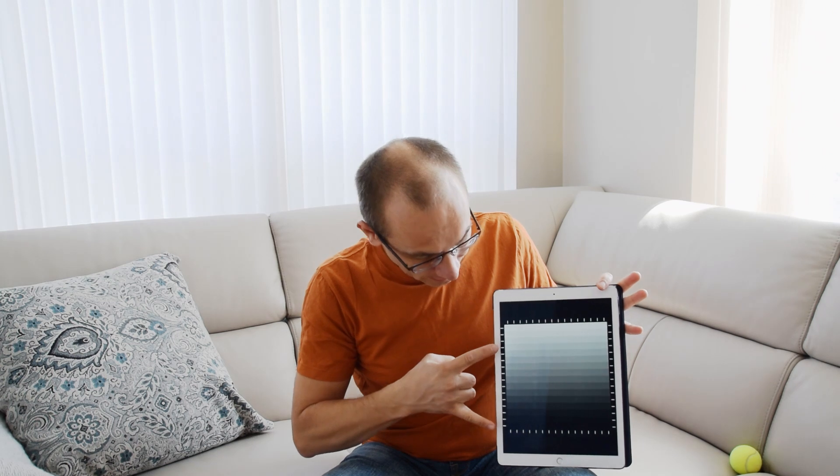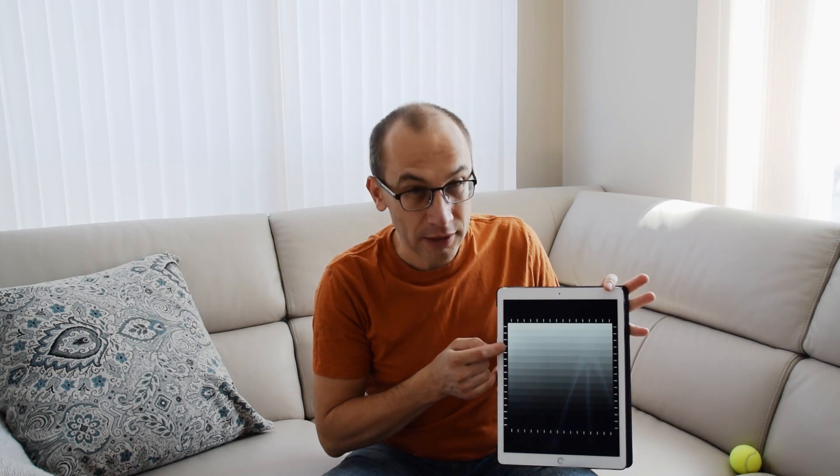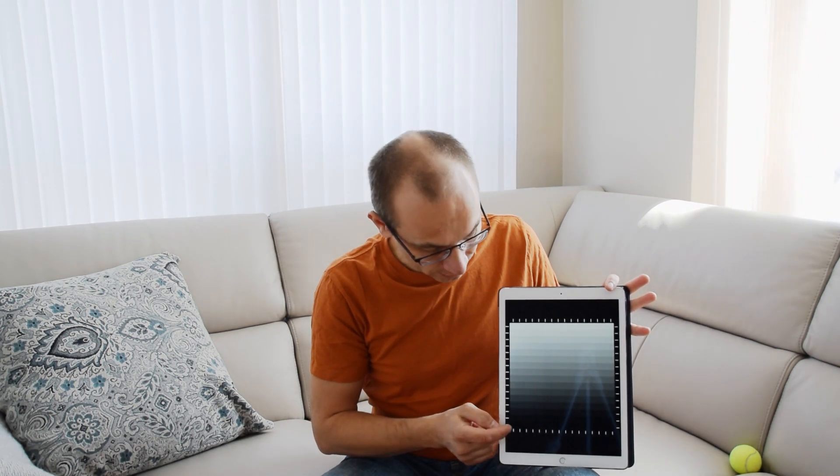We set up our machine correctly by making sure that the top three or four lines on the stone are as bright as it gets. With diamond engraving machines, which cut much deeper than laser, you can actually move your finger over the top of the engraved square and feel it — the polish is completely removed. But if your image only contains colors in the range from zero to 200 or even zero to 180, it will never have a chance to engrave those bright colors and your image will look very dark on the stone.